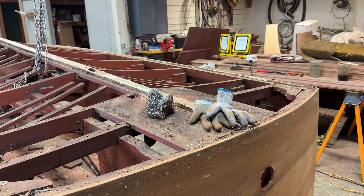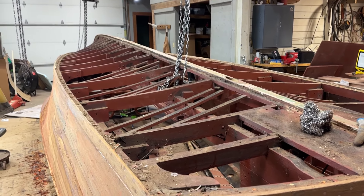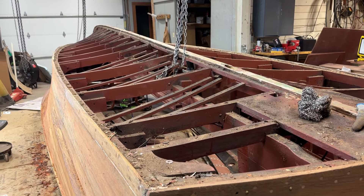We have one little bit of repair to do right here, and I believe on the other corner we face just a little bit as well. The problem is that this joint sits behind the barrel strips, and so it tends to capture and hold water. We have not taken the spray rails off yet, and it's so often the case that we find quite a bit of rot behind them. Right now I don't see evidence of rot, at least having migrated beyond the joint. But we'll know more once we get it apart.